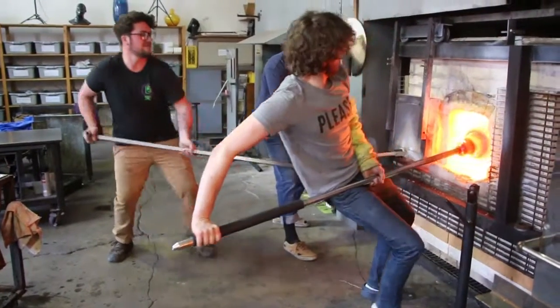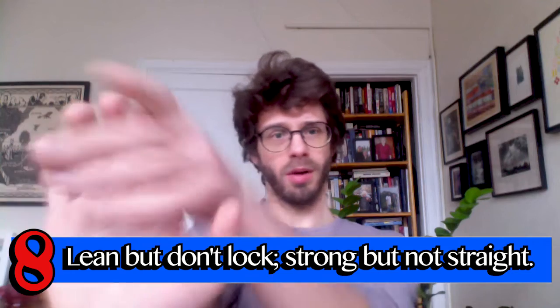It's the pure physics of it, not humongous biceps. The glass on one end of the pipe is counterbalanced by your body weight on the other, with your hip acting as the fulcrum. To make that happen you have to lean back, extend your body back, and transmit that body weight through a relatively straight arm down to the end of the pipe as far back as you can handle. An important point: don't ever lock out your arm or let your wrist collapse as you're trying to turn — that's bad for your tendons and limits your mobility. Keep your arm slightly bent, arched out, and keep your wrist on the far outside of the pipe so you're rolling it in an open grip. When you come out, the first thing you want to do is bring the glass as close to your body as possible, then slide it towards you.